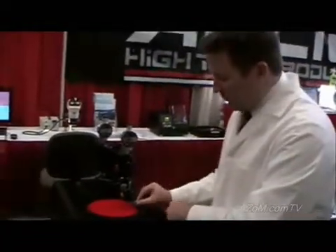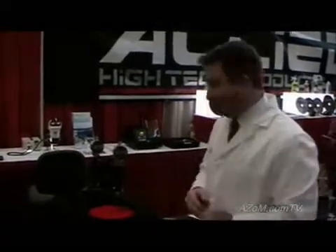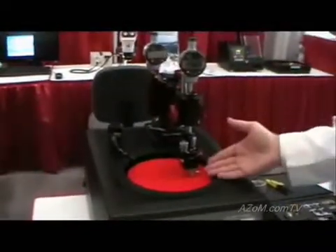The fixture is secured mechanically with a cam lock operating tool-free, which means you don't have to look for Allen wrenches or screwdrivers — they don't get lost, it's all contained within the system. The cam lock assures very accurate repositioning of the sample, so as the sample is removed for observation you can place it right back into its previous location without losing its geometric orientation with the grinding plane. The fixture is loaded onto the cam lock, and then this cam riser allows you to lift it without adjusting its vertical position.